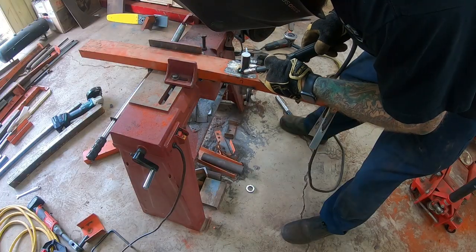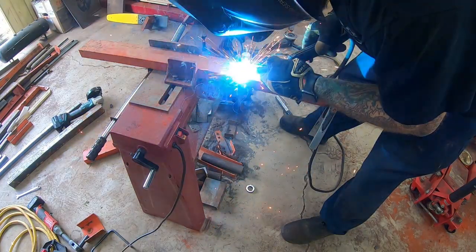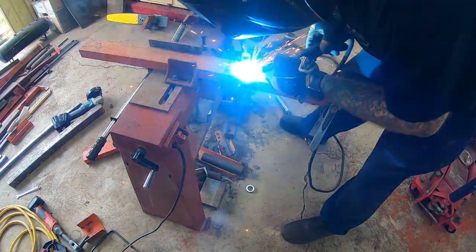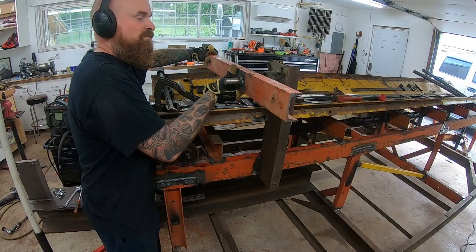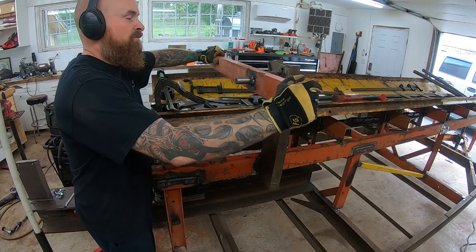This is a spacer. I had one on each side that I welded in after I welded the shafts, that way the spacer would contact the edge of the bearings and keep any side play down.